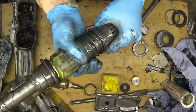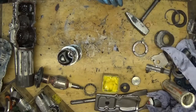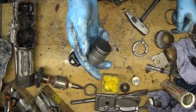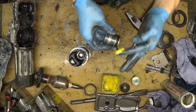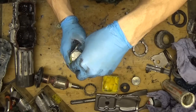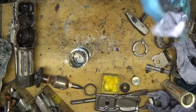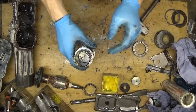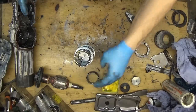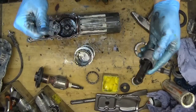We have the oil. One thing I want to do now is put the striker inside the tool - as fewer parts left on the table the better. Don't forget the O-ring goes up. If you turn it around the wrong way you will hear an awful sound - it will hit, not hard, but it will be an awful sound when hammering. Now this part is inside and we need to put this one inside the cylinder housing. Before that we have the piston.